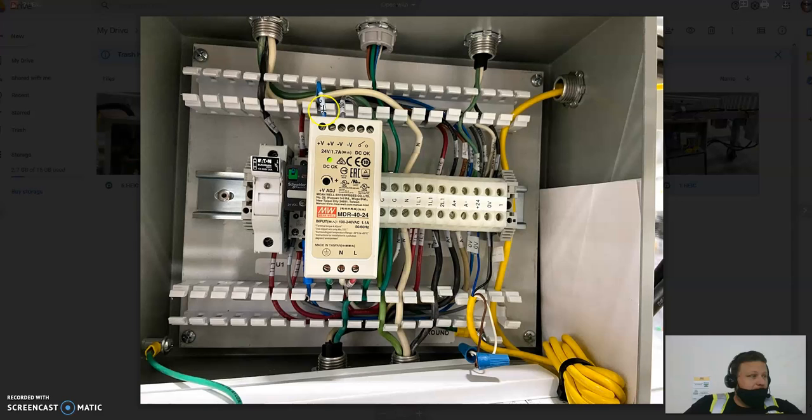That plus-24 line loops over here and actually ends up looping back around to the bottom of the relay. This is a 24-volt DC relay that gets energized by the 24-volt DC voltage. The 24-volt line loops back around; the other line comes into the terminal block. At this terminal block you have your plus-24, your zero-volt, and your 'one' — those three lines are your control lines. You get one of each that goes through the middle, one of each that goes out to the switches, and in this particular line there's also a photo eye involved that these lines feed as well.